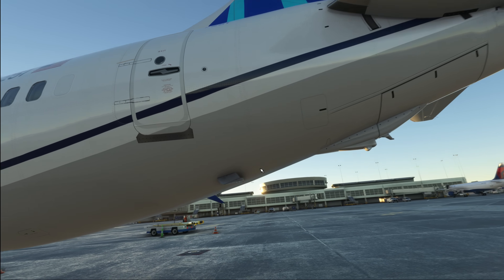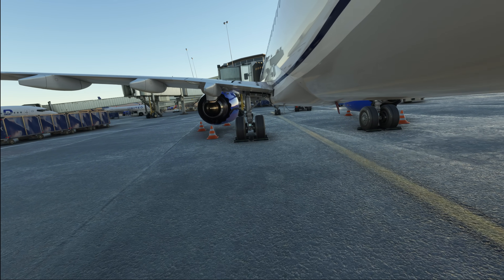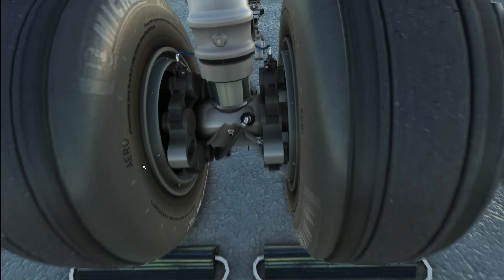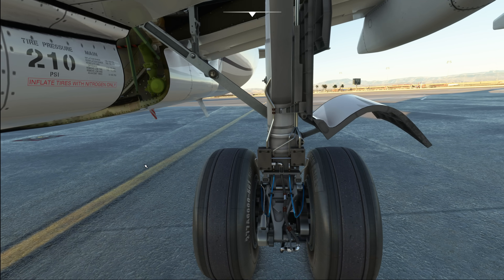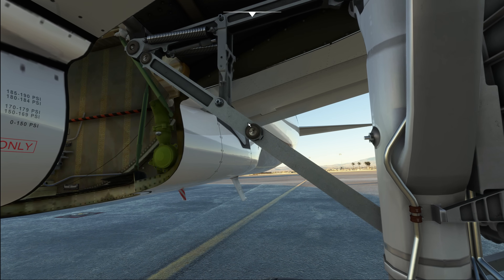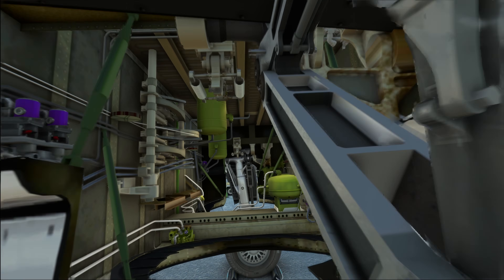On the left-hand side of the aircraft, we basically check the same items as the right side. We check our leading edges, move along the front, make sure there are no damages and the door handle is flush. As we get to the left main landing gear, we check the brake wear indicator pins up here to ensure sufficient brake energy remains. Moving along the side of the wheels, we ensure there are no damages and sufficient tire profile. Also make sure there are no birds anywhere in here, and that the landing gear lockout pins are not in place — if those are in and you try to retract the landing gear, nothing will happen.